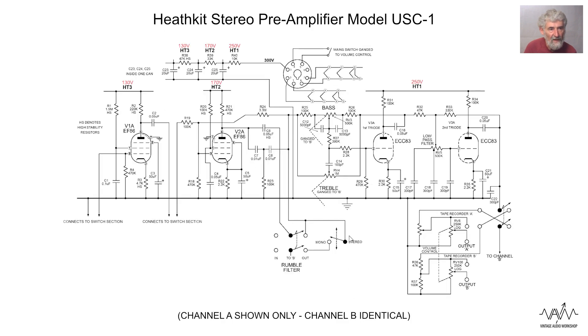There is another complication - the mono-stereo switch. One needs a mono-stereo switch either because one has a mono source and wants it to come out of both speakers, or because one has a noisy source. By switching into mono, one often reduces the effect of either surface noise on a record or noise from a tape recording. Also, if one has an FM stereo tuner without a stereo switch, there is a degradation in signal-to-noise ratio of about 30 dB between stereo and mono. So if you have a noisy signal and cannot switch to mono on the tuner, you can switch to mono on your pre-amplifier and the signal-to-noise ratio will greatly improve.